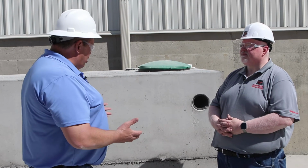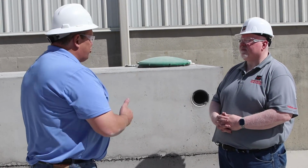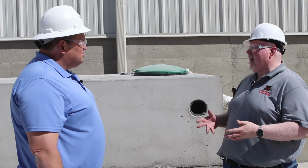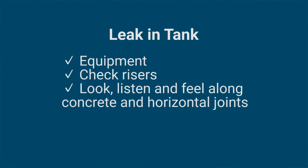All right, well, we were fortunate enough to have a successful test, but what if we were losing pressure? What are the first things you would look at? Well, Claude, the first thing I would look at is if there is a leak in the tank. I'm going to check the equipment first, make sure that there isn't a leak in the equipment. The second thing that happens most often is a leak in the risers. I will check those next. After I've checked those two more obvious things, I'll look at the tank.